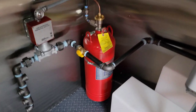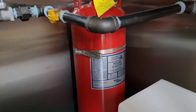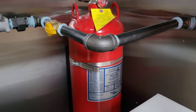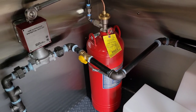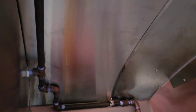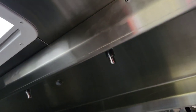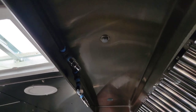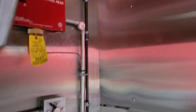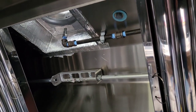Let's walk in and see the fire suppression system installed. That's the Husky coin gray flooring — it's been really dependable. Here is the tank: it's a Kitchen Knight PCL 300, installed right here with the special chemicals in case of a fire. That black gas pipe goes all the way up and over. On my original food truck they ran this on the outside, but now they install it inside — look at that clean install. There's the pull station, which goes up to the control head, which controls the fan, and then it sprays right in there.